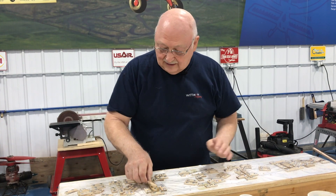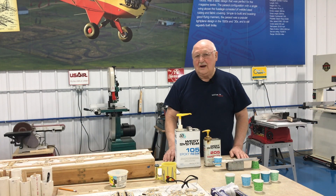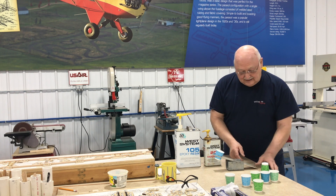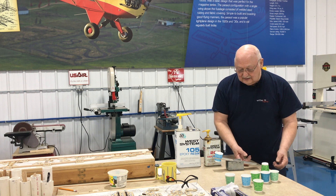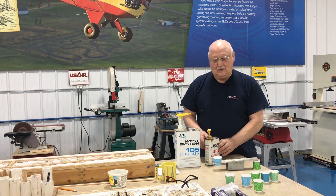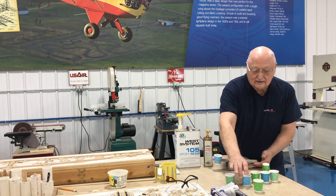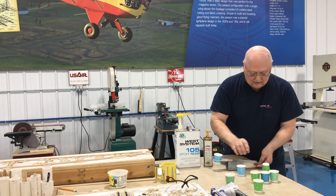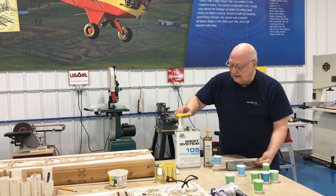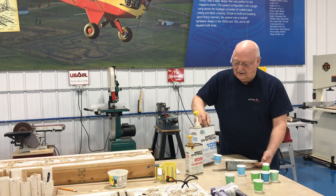So the parts aren't pulled up by the plastic. Just leave it hanging there because you'll use more than what you expect. Fit all your vertical pieces in first, and as you can see, it pulls the plastic up. For mixing our epoxy, we're using the West System. We've built our own little beam balance that balances out, and then we add the weight to it because we're mixing one to five. We're using washers for weights. We insert this weight until the beam lifts off, and then we add the other five washers to it. Using weights like this, you have to get them exactly in the same spot every time. Then we add the rest of the epoxy, pump it, and we have a mix.